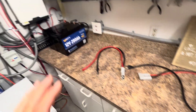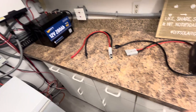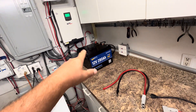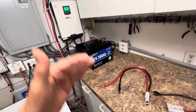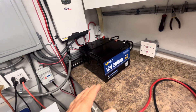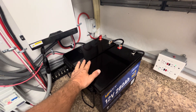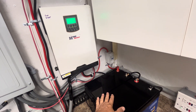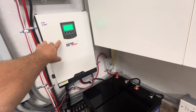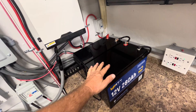We're stuck where one battery is at 100% and the other is at 93%. That's not going to work because after just one week it's already degraded 7% in difference between the two. The BMS inside is not allowing them to charge equally, and the gap will likely get wider the longer we go. We may need to use inverter or battery settings to equalize — I'll have to contact WattCycle and ask.